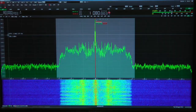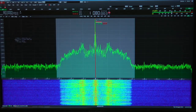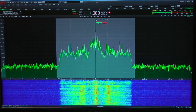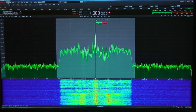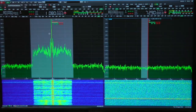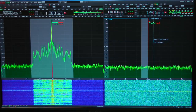And now we're in the ARRL lab, and we're looking at AM 1080 front and center — carrier and its two sidebands, here and here. Frequency readout is here. This transceiver has two receivers. Let's turn on the other receiver. And there you go — the AM broadcast band on the left and 40 meters on the right.